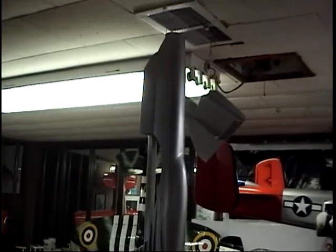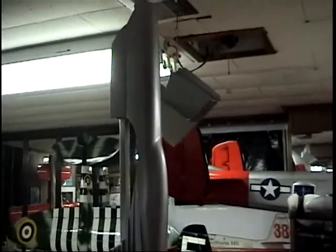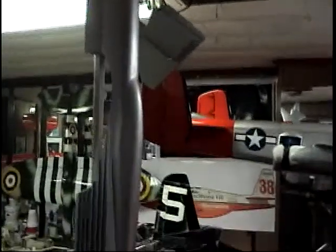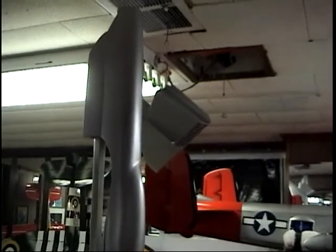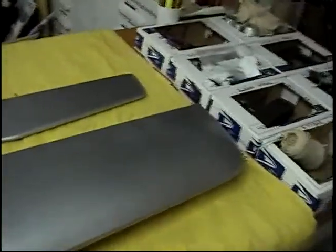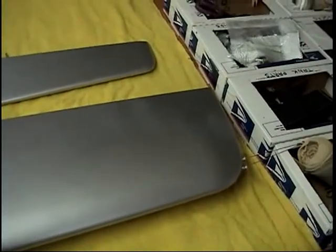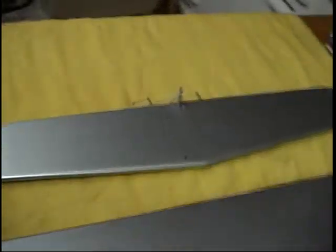We gave another coat of silver to this, sanded it out, and we're working toward having some reasonably nice crisp corners on the fillets and canopy edges. I made a pattern out of tin foil of what I hope is going to be the canopy shape - Les and I will discuss it more and try some more different shapes. The back of the fairing and the back section I'm still not satisfied with - it's going to need a couple more silver-primer-sand-out cycles. The wing tip finally looks good after a thousand repairs.